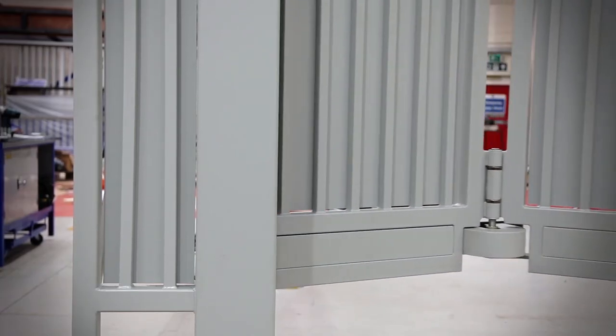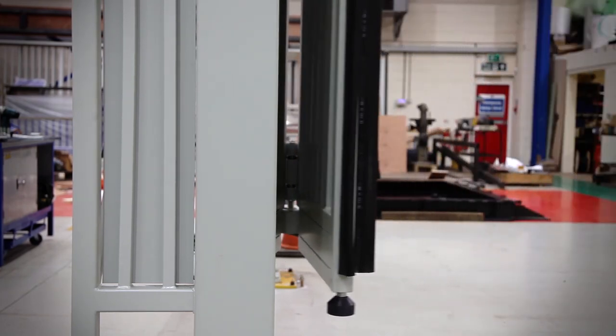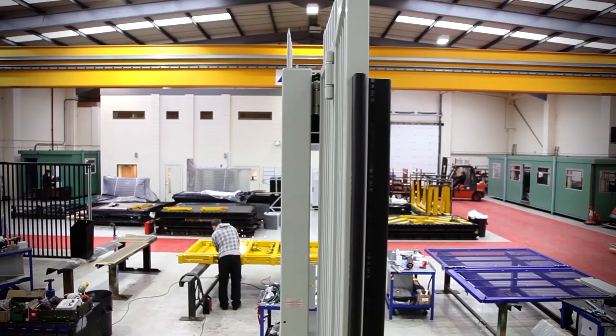This particular gate is operating at 8 seconds. The safety equipment fitted to this gate includes photoelectric cells. The photocells are transmit and receive type, providing more reliability particularly in rain and fog. This gate also has active safety edges fitted to the leading edge and inside to prevent injury.